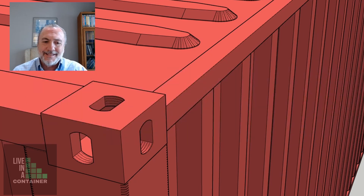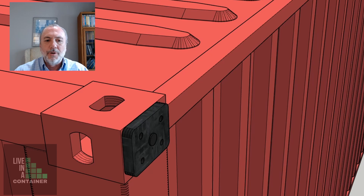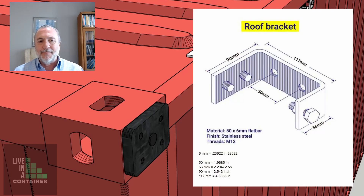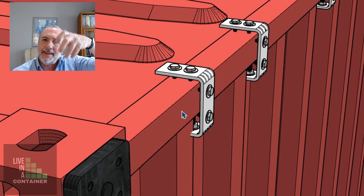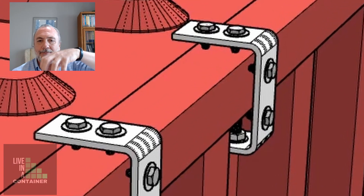There's an insert inside of the hollow of the corner casting, and then there is a plate that is screwed into that corner casting and clamps it together. This means it doesn't require you to connect the trusses or the truss supports with any connections that penetrate through the shipping container, because when you penetrate through a shipping container it's not going to be watertight. They also have a secondary element — a bent metal clamp with holes on the top and one hole on the bottom — that clamps onto the top side rail of the shipping container.